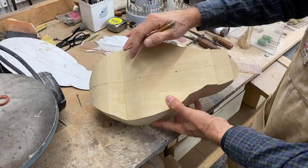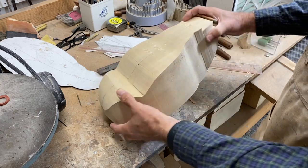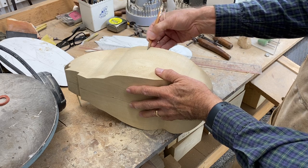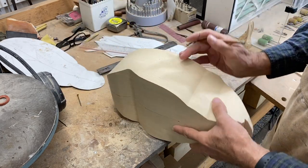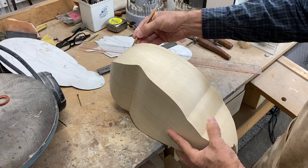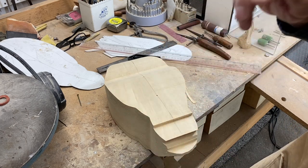You can see I put a center line back on the decoy just to give us a guideline and perspective. Then I'm going to do some angle cuts on the bandsaw to remove some of the lower wood on both sides, and also some angle cuts to take off some of this bulk wood and begin to round the decoy body.